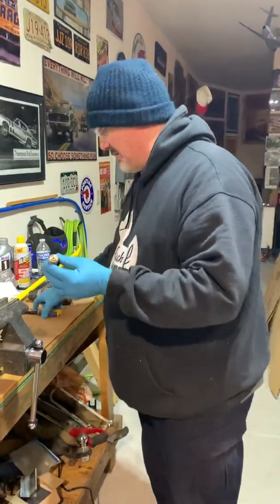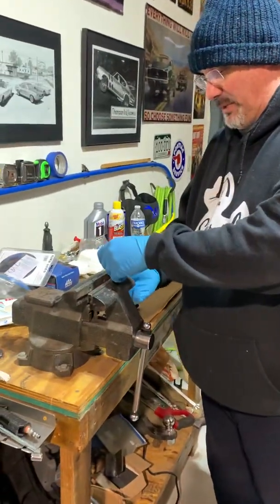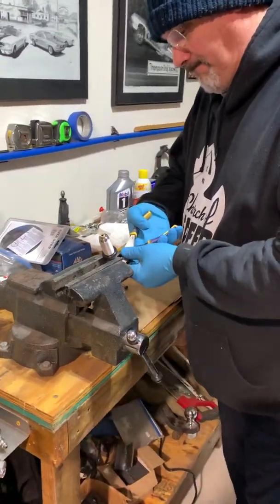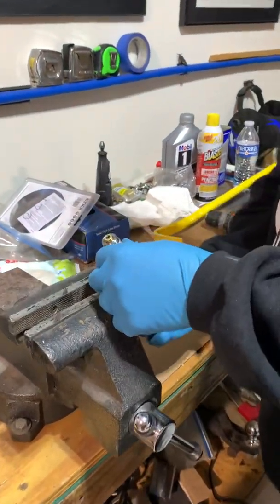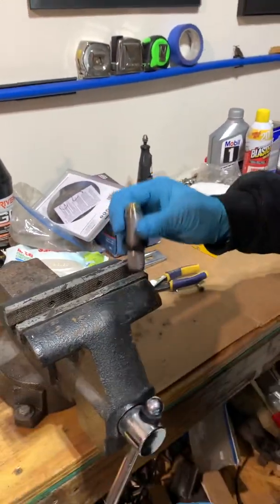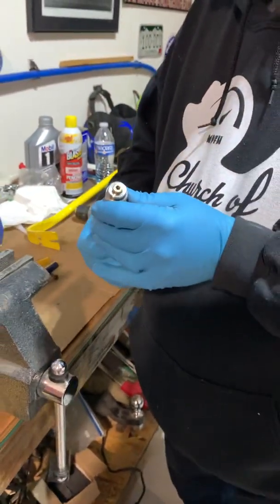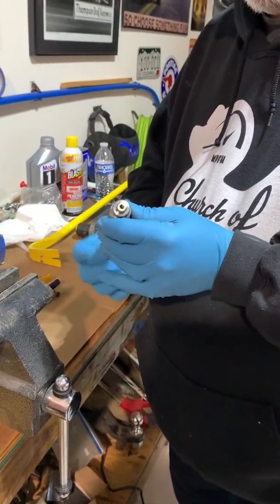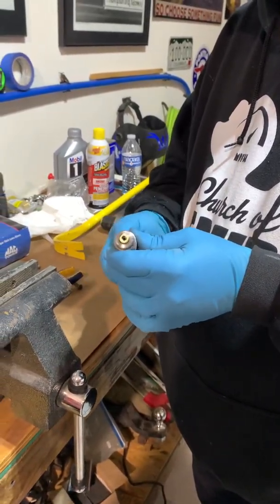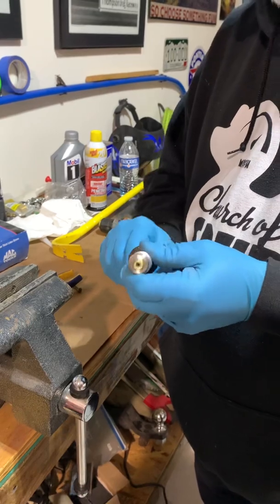But first thing, you got to get out the neck die, right? So let me pull that out. For the loosen that up so I can get it out. Otherwise, the decapping pin's in the way. So we're going to back this off, and I'm not going to be able to get it out of the piece of brass. So it's going to have to just sit at the bottom of it. And hopefully stay out of the way while I drill and tap this piece out.